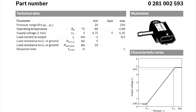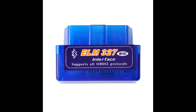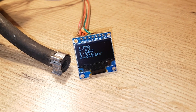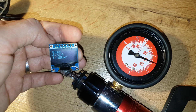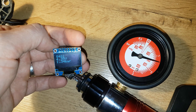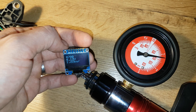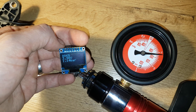So what are the advantages of using a Bosch pressure sensor over an analog gauge, OBD Bluetooth, or LCD gauge? First of all, Arduino is fast. OLED has a really good refresh rate compared to LCD, and the Bosch pressure sensor has a response time of 1ms. Analog sensors are fast as well but are much less accurate. OBD Bluetooth has a huge lag of 1.5 seconds, so any values you see on your smartphone are values that are 1.5 seconds old.